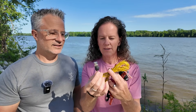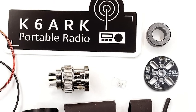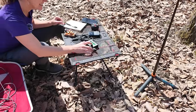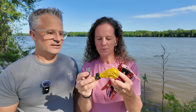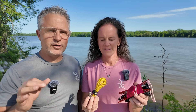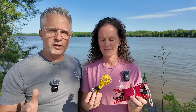This little one is the K6ARK end-fed half wave, which actually has a circuit board and a toroid built right into this little tiny piece right here — and I built that. This plugs right into your radio, which is a fun part about this one — it does not require coax, whereas the Extenna does. The reason we love end-fed half waves and why they've become our go-to is how easy they are to set up.